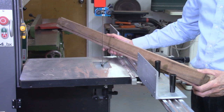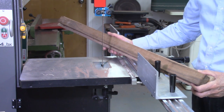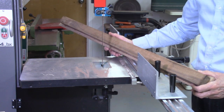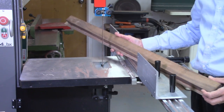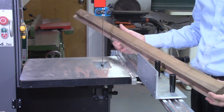I did a previous video on cutting long boards on the Accu-Slice system. On the Accu-Slice system, you can cut long boards up to 54 inches long using an 8-foot rail. So in this case, I have a long board. This board is probably about 4 foot long, and I attached it to a piece of MDF, or I could use plywood, just some scrap wood.